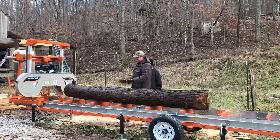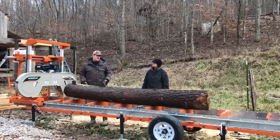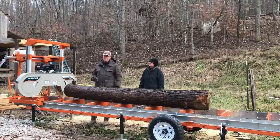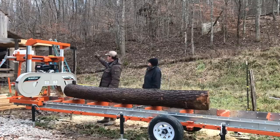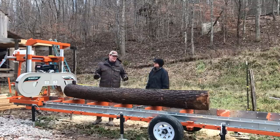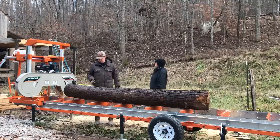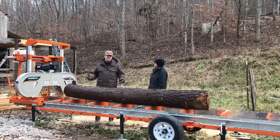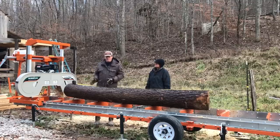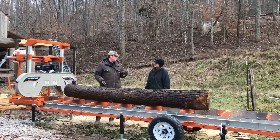But I could actually do that knowing what I need these 2x4s for. I need them for our chicken hoop house, which doesn't require 8-foot-long material — most of the stuff is going to be 5 foot. And then right back here in the loft, we're going to build the knee wall, which is 6-foot high knee walls. So I could literally get away with this and get a cleaner cut. It's a shame to sacrifice this piece, but if I try to cut all that out, I'm going to have a lot of wane, or I'm going to make my cant so much smaller that I'll lose material all the way down the log. So I think we're going to cut this off on the mill carefully with the chainsaw without injuring the chainsaw, the mill, or myself. Good plan.